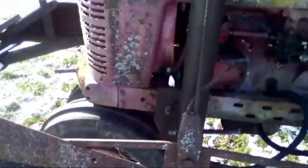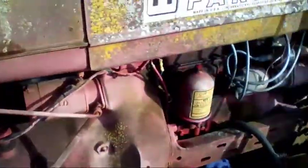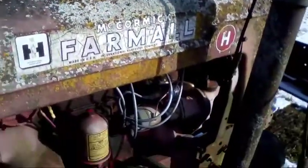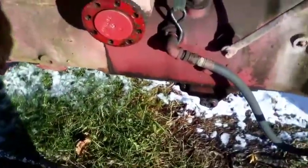I'm gonna keep it up because it doesn't seem to lose pressure when it's up, but when it's up it exposes the clean part of that cylinder and it keeps all the fluid inside, which is a good thing because I want to try to not have to add fluid constantly. I know it's just that cylinder too that leaks. It's actually not the reservoir.